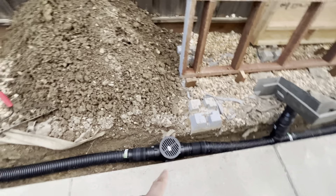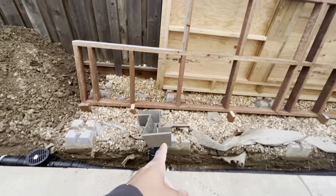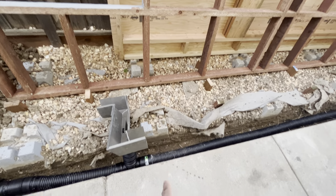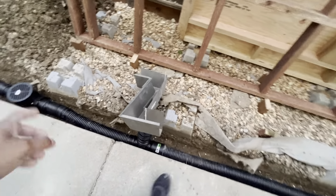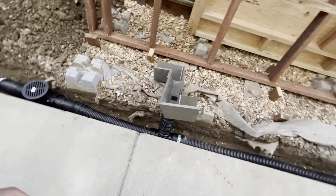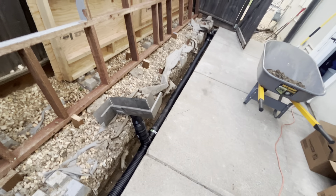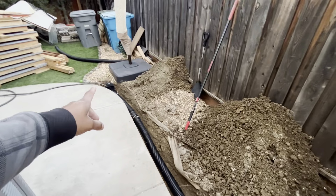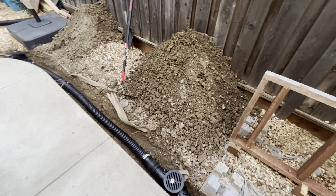I put an additional drain right here. The secondary door to the shed is going to be right here, and the primary door is over here. You can see the cutout — that's the width of the secondary door. There's a slow cutout right here that comes onto the pavement, and that's where I'm going to put the downspout drain off the shed. I have the downspout already but this is just a mock-up of the angle, making sure I have all the fittings. I can manipulate the flex pipe if I need to with adapters.